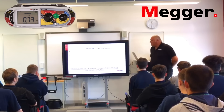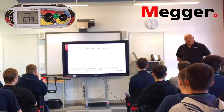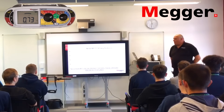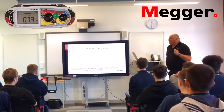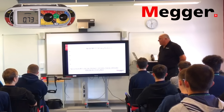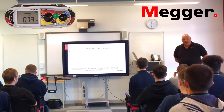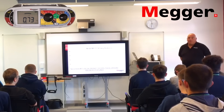It has RCD uplift immunity — there's no RCD or RCBO uplift, so when you're doing the loop test it doesn't see any uplift within those products. It also has the ability to test 10 milliamp protected circuits — that's an industry first. There is no other tester on the market that does that. We've patented the lot.